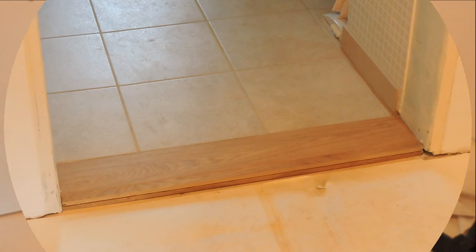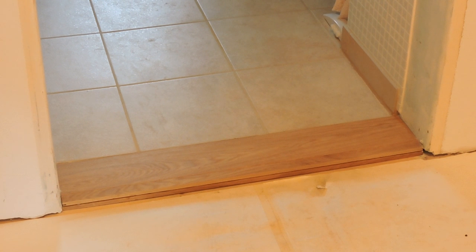I'm going to use white laminated baseboards in this part of the hallway because the walls are white, and it's just the simplest way to do it, I believe. So as soon as I get my board made and glued, I'm going to use two-component epoxy glue to glue a front edge on a lip on the board. Then I'll show you how I'm going to mount it and get it up to the correct height. Bring you back later then. I haven't routed the front edge yet, but that's the look I'm going for, basically.